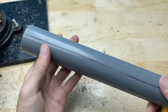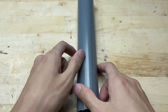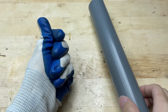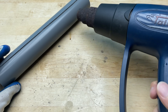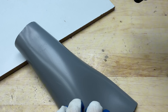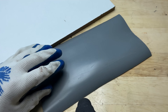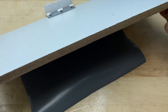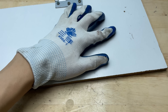After the cut, the next step is to heat it up with a heat gun so the plastic becomes soft and easier to shape. Make sure not to touch the hot surface directly, and it's a good idea to wear gloves to avoid burns. When the pipe is soft, I'll carefully open it up and flatten it out, then place a piece of wood on top to hold it flat while it cools and hardens.